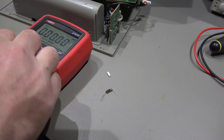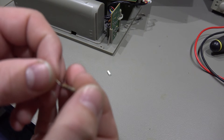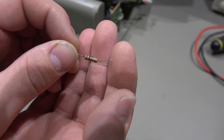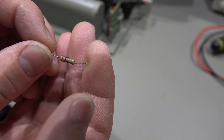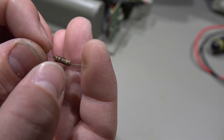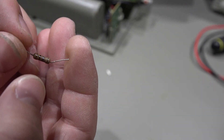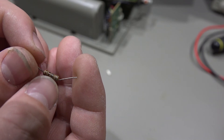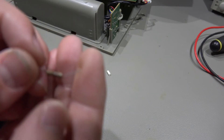So let's look up that resistor value and see what that's supposed to be. Having a closer look at this resistor - I thought it might be brown, black. I think it's either brown, brown, silver, or because it's blackened, it could have been orange, brown, silver. So orange, brown, silver is going to be about 0.33 of an ohm, and brown, brown is about 0.11 of an ohm.